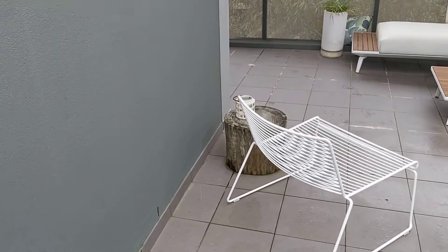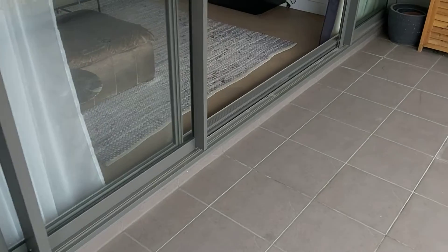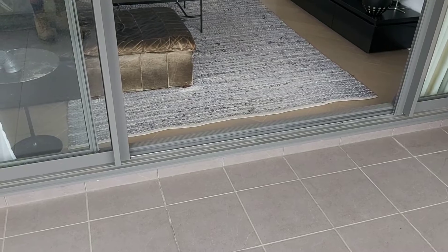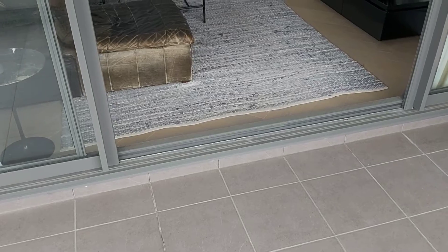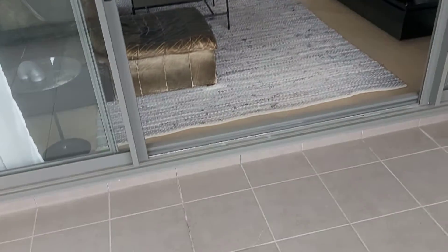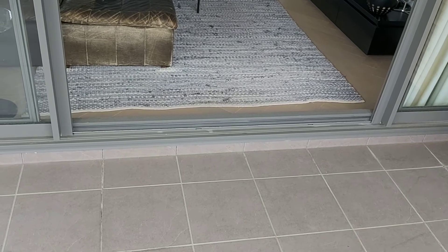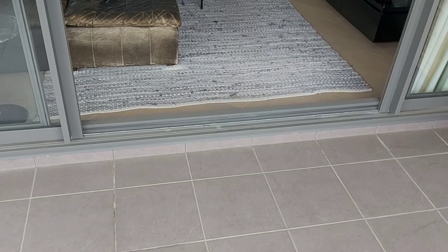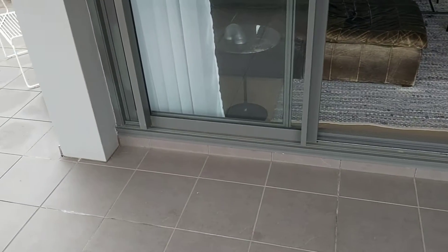Round into the lounge room, historically there's been a water leak internally to the sliding door. Looks like there might be a waterproofing turn-up bandage issue under the doors, as we're under cover here on the cantilevered concrete slab. There's a lot of water and efflorescence under the tiles. I think we have to pop off the timber architrave beading and flood test this area to check for water leaks, and also flood test and spray test the subsill flashing.